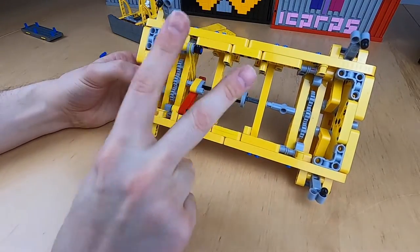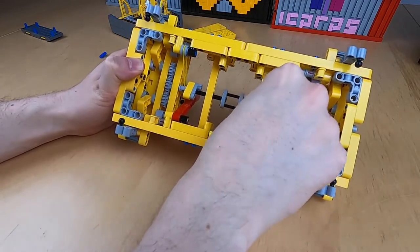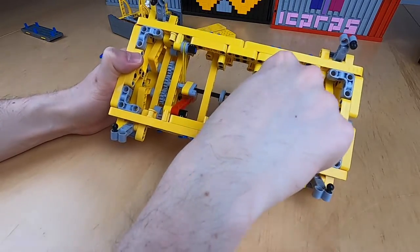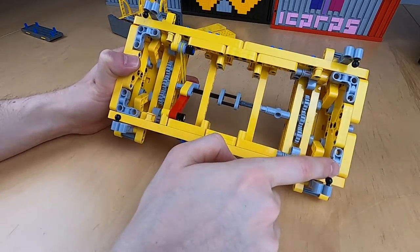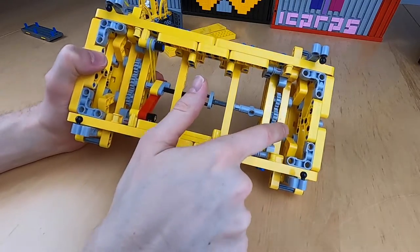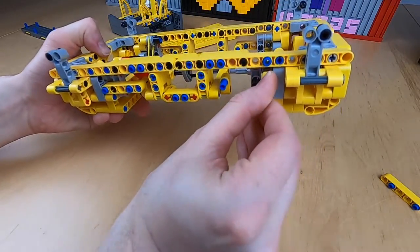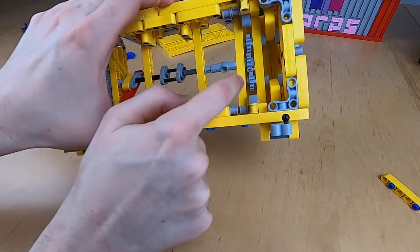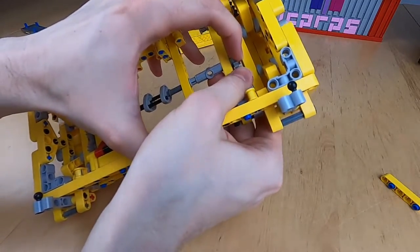Now if you are building your own, there are two things to look out for. First, the mechanism should be running completely smooth, otherwise it is not working well. Second, you have to build it correctly so that all fingers are in at the same time while this middle assembly has a 45-degree angle. Should you have a misalignment issue, you can adjust it by removing these parts and pulling the axle out a bit, then pulling the middle gear to one side and the one holding the finger to the other in order to turn it just one tooth.